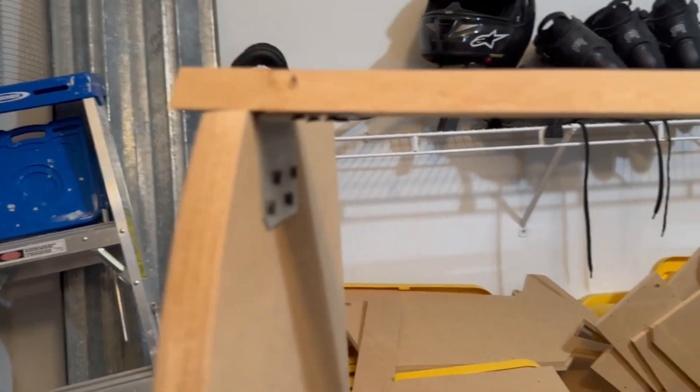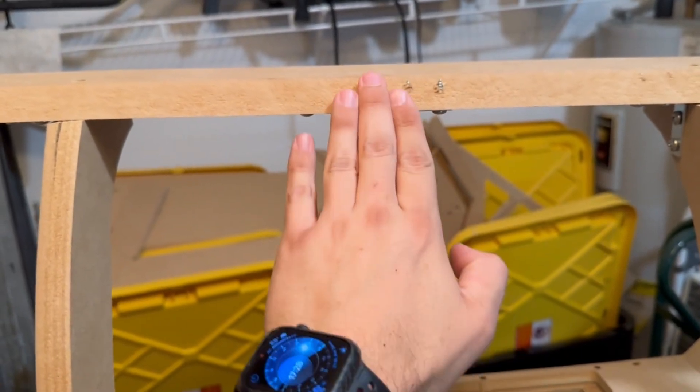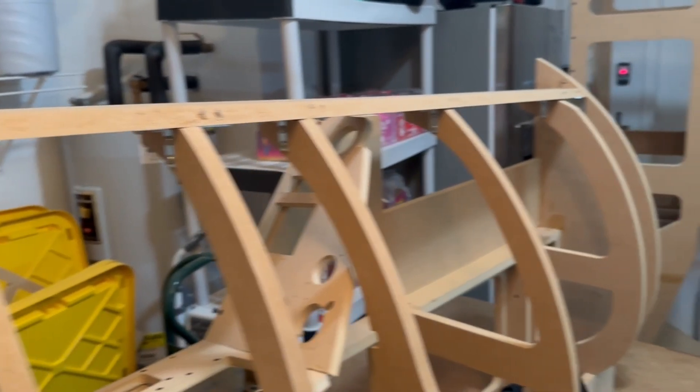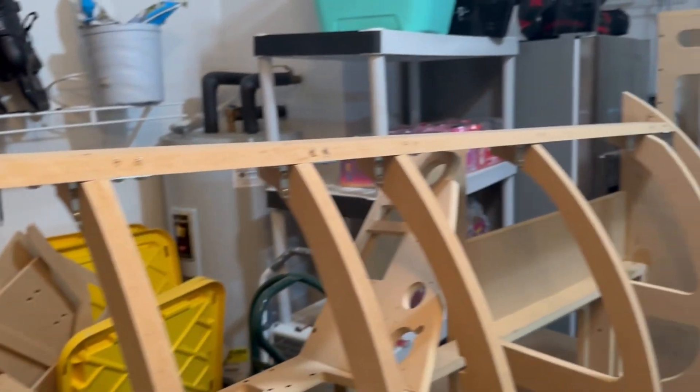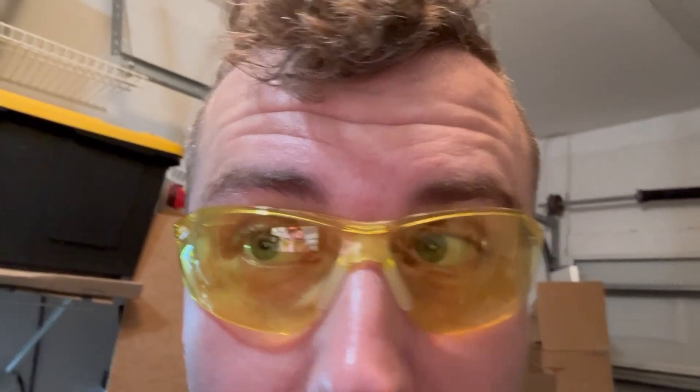For cutting these little bolts off, I just got a Dremel with a standard metal cutting tool. I'm going to chop the little bits off there — maybe go deeper than I have to because I can just cover it with this wood spackle. These are going to get sanded down with regular sandpaper. I'm not going to go wild on this part yet because it's up against the wall and I'm not entirely sure how I'm going to do this. But for now, it's just cleaning up the bolts sticking out — they're the number one offenders right now. And it's absolutely essential that you wear eye protection. These things are going to send sparks going every which direction.